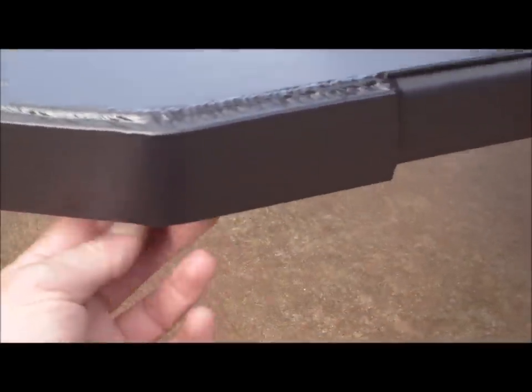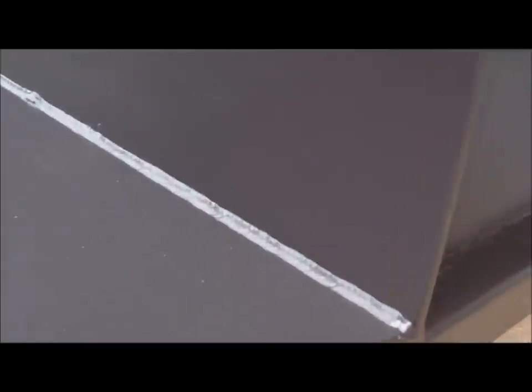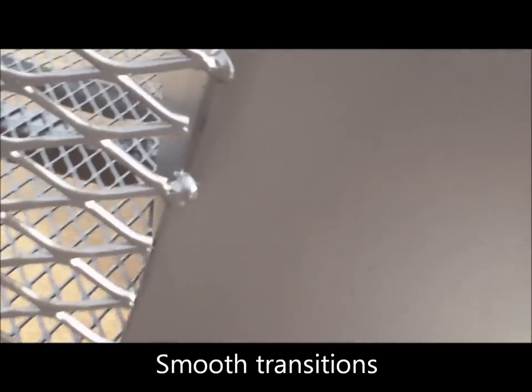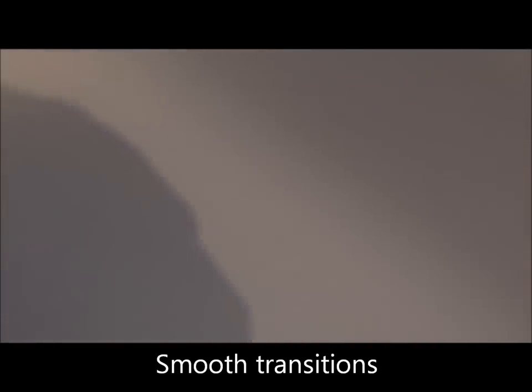If you look under here, there's also a two-by-two square tube, quarter-inch thick steel, that runs all the way across to the other corner. This trailer's not going to break on you. You can see where the upright is welded to the trailer — all quarter-inch plate. You don't see any seams where the pipe and the plate meet; we fill it in with weld, come back, buff it out nice and smooth and clean. Just custom quality.